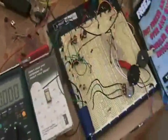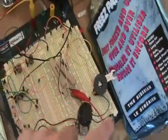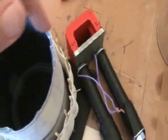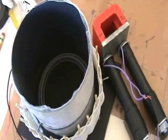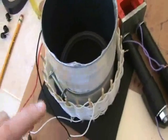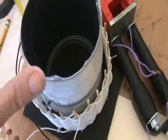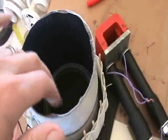Let me explain this setup again. I've got a 555 timer circuit here with a 2N3055 to basically pump a pulse into this solenoid arrangement. The idea is to create a vortex in this cylinder, which is a magnetic flux, and then sort of try to study the tank circuit here, which is just a coil and a capacitor. This capacitor is unusual in the sense that it's surrounded by a cylinder that is metallic and magnetic.